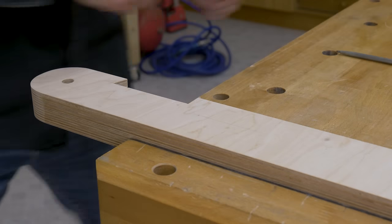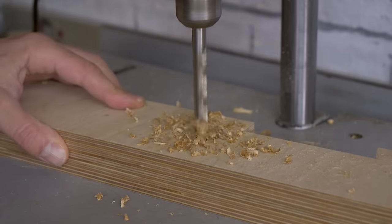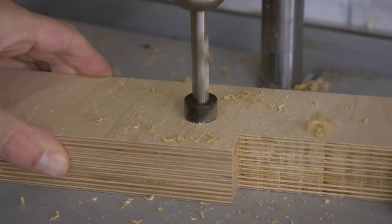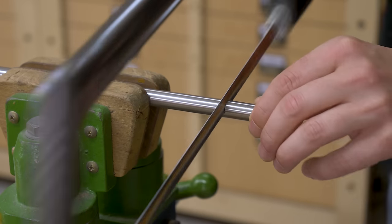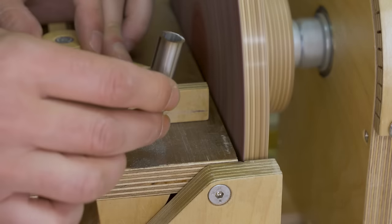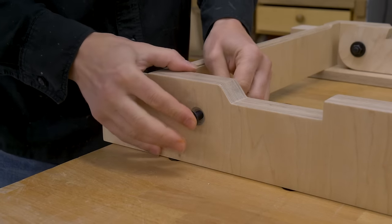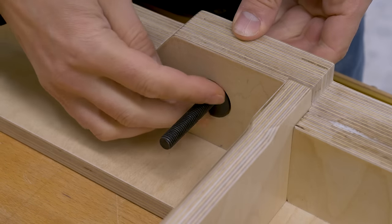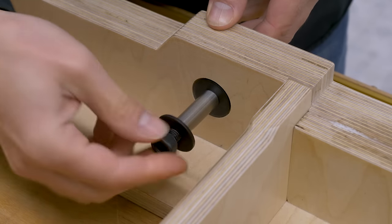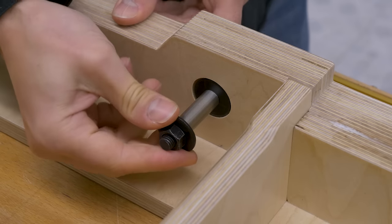On two of the legs I have to pre-mark and drill holes so that I can install the base handles. I'm going to cut the steel pipe pieces needed to make the rotation axis for the legs. It's important that the ends of the pipe are properly square. I'll put together the entire axis system to get a better feel for its operation: first I insert the bolt into the hole, then the washer and the steel pipe, and finally a locking nut holds all the axis parts together. It's a very firm system and I think it's perfect for this project.